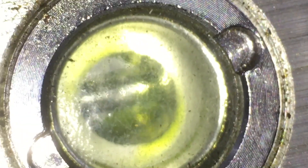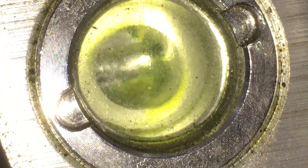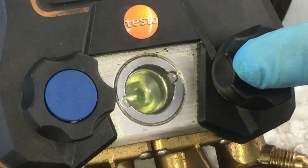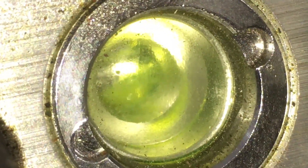If you have a large sight glass like this, you can actually see the refrigerant going through there. That's oil that was already in the system, and that is the refrigerant blowing by. The refrigerant is in vapor form, shooting in this direction and coming out down this line. What you're seeing is not oil being removed - what you're seeing is refrigerant vapor blowing past existing oil in the sight glass, just swirling around in there. If you actually had oil coming out, it would be building up in the sight glass down below.